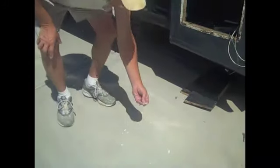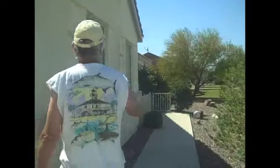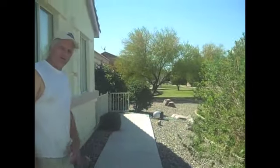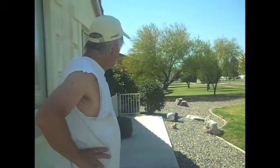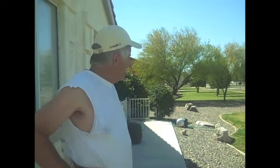When I drained the heater last night, you can see the calcium that came out of it. So we've had a lot of that with it. What I've done is I have the heater over here, and I filled it with water and a little bit of vinegar and let it sit overnight. So I'm going to drain that in a little bit and flush it all out, and hopefully that'll get all the minerals out of it.